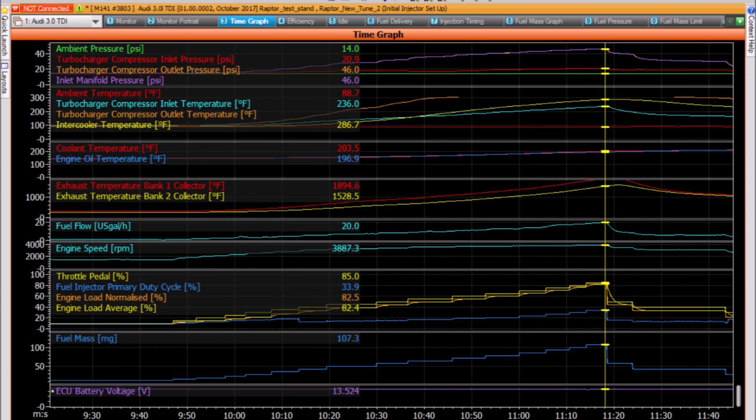You can look at all the other results, but I just wanted to show the maximum setting. We hit about 1900°F on the EGT. I looked up these turbos and they can handle about 2050°F sustained, because the turbine wheels are made from Inconel which has a melting point of about 2500°F. So hitting 1950°F just for about 10 seconds is not a big deal. I suspect the cylinders aren't that hot because everything from six cylinders is going into one little turbo inlet, so the temperature is rising as it enters the turbo, but it can handle it.